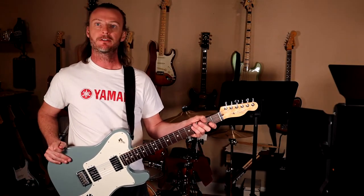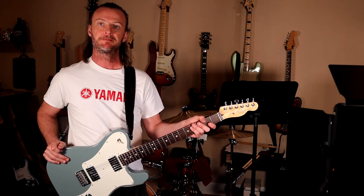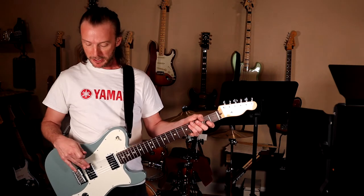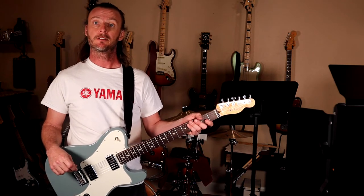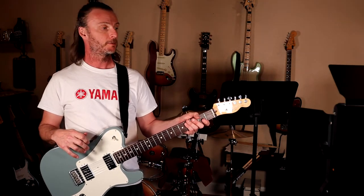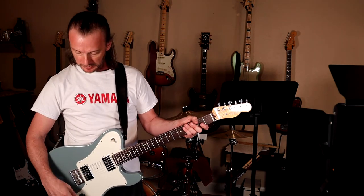All right, we're back from the bench. Got the guitar strung up, tuned up, and it's the moment of truth. Will the wax between the cover and the pickup solve the squealy microphonic feedback problem? Does Dylan know what he's talking about? All will be revealed now. Let me take the amplifier off standby. I've left all the settings the same as before, and we'll just see if it squeals.